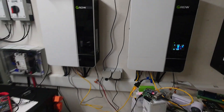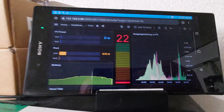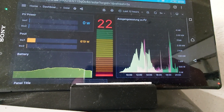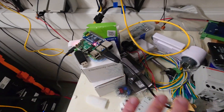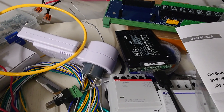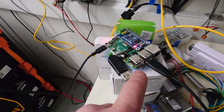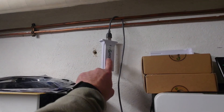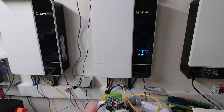I'm sorry for the last few days — I had issues with my Raspberry Pi and my reporting. It looks a little different right now because I have to rework all the dashboards and get all the data back from the database since the SD card was broken. Right now I'm using an SSD — a Samsung 840 EVO — and the next step will be getting the relay board back into work and figuring out how to get the Raspberry Pi working with the RS485 communication, so maybe we can get rid of those Growatt ShineWifi sticks.